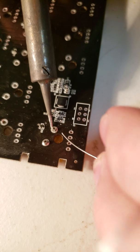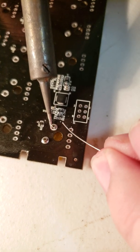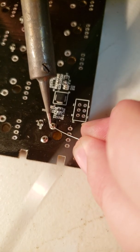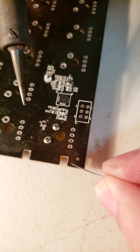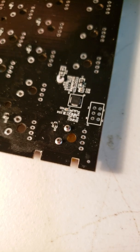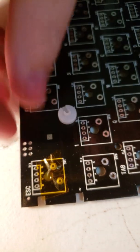With the 7305s, you want to be really careful because you don't want to get any of that solder in the socket. These are a little more forgiving just because they're longer. So that's soldered now — just turn off our iron and remove the tape.